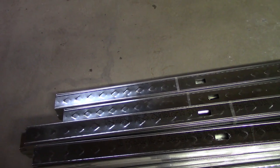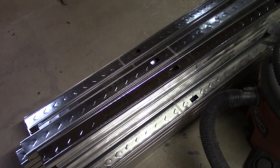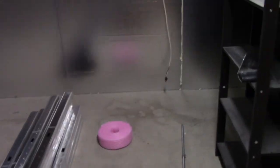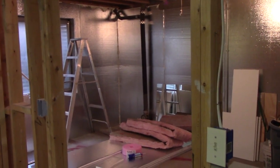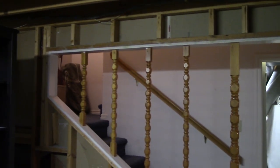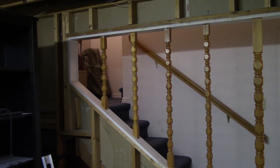This is 25-gauge steel, I think - really thin, galvanized coated for corrosion resistance. If you needed structural and commercial, when I worked commercial construction you'd absolutely get structural steel studs - they're a totally different profile, way thicker. Fun thing is my basement here is 7'2" and that side is 7'8". That's one of those instances where I'd love to beat the architect for doing stupid stuff like that - it means the living room right above is a sunken floor from the rest of the floor plan.